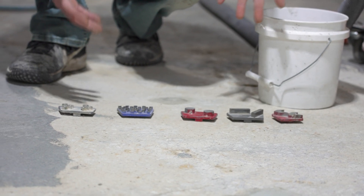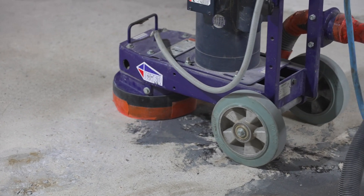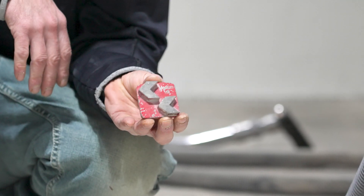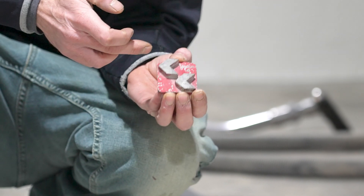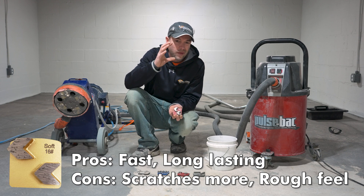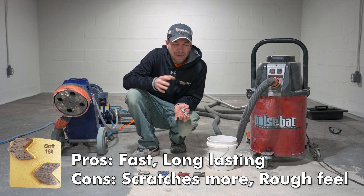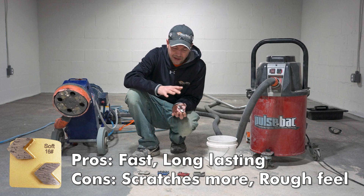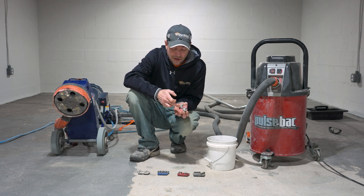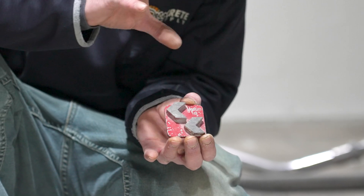This is the floor that we've actually been in the middle of grinding — it's a really old floor. We're removing paint from this floor, so it's really nice to have a lot of different things at our disposal. Going down the line, starting with shape: we have what's called an arrow diamond here. This is made for a smaller unit, this Ditec 8-inch machine, and this is really all the way on the most aggressive side of things. A part of the reason for that is you can see the way it's shaped — these are all sharp edges and we have a lot of sharp cutting surface hitting the concrete.